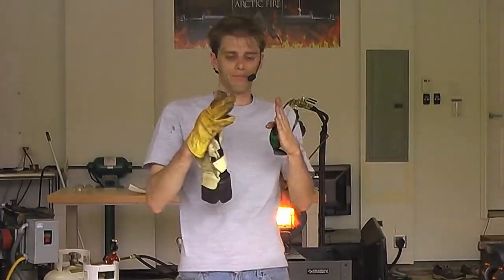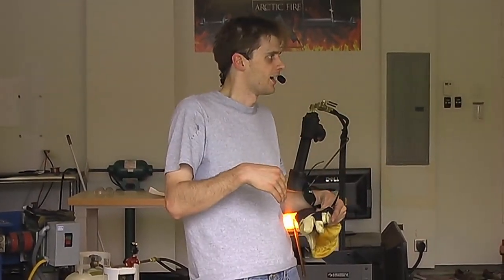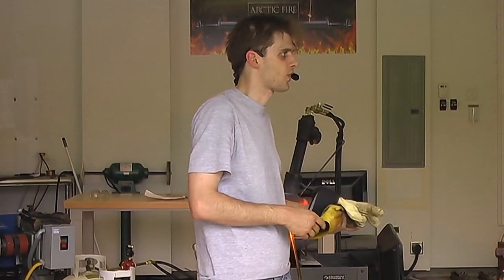When you're forging that material down, it has to go somewhere. Just think about it, if you take some clay and you squeeze it, that material has to get pushed off to the side or it's going to get pushed out. And if it gets pushed to the side, which it naturally will, it's going to elongate that edge. So if I just keep hammering on that edge and pushing that material out, it's going to form an arc. So, if that answers the question,